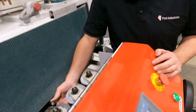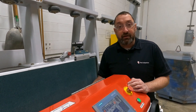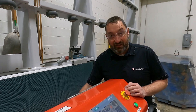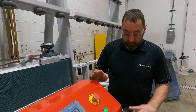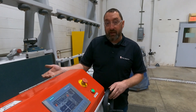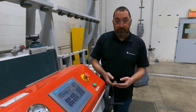If it's stuck and you cannot lift it, then your spindle is stuck and you need to go through your spindle and clean that spindle up to get that freed up. We will go through that later on in this video. But the next step is to double check your air — if your spindle raises by hand, then we want to check our air to see if it is an air issue.